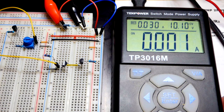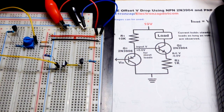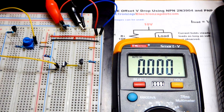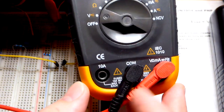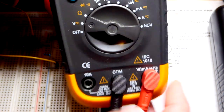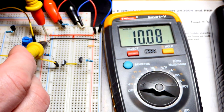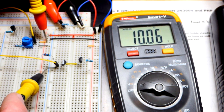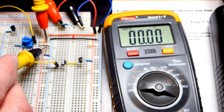We'll turn the power on — there's a little current flowing now throughout the circuit. We'll use the multimeter here. I have it set to measure voltage; I don't need to move the red probe for this video. Black stays at COM. We can measure voltage, milliamps, microamps, and everything else. Measuring the rail, the voltage may shift slightly due to wire resistance, but not significantly. We have ten volts across the trim pot, set about halfway.